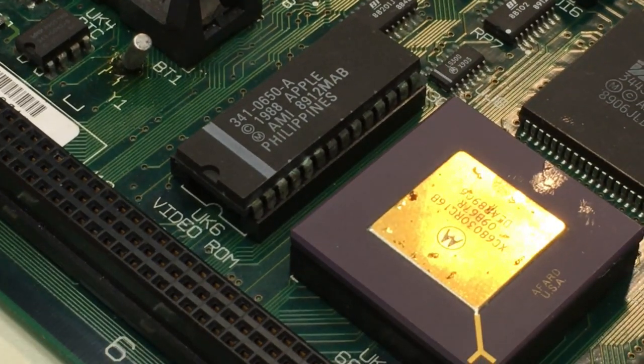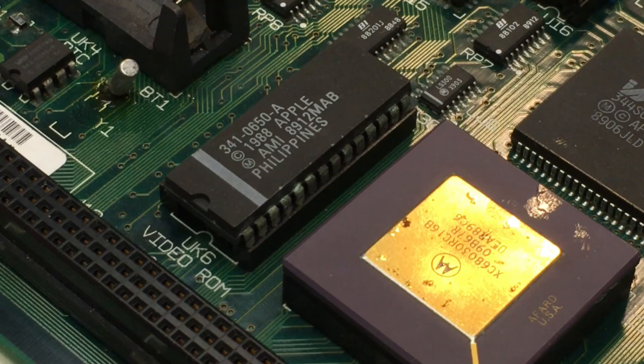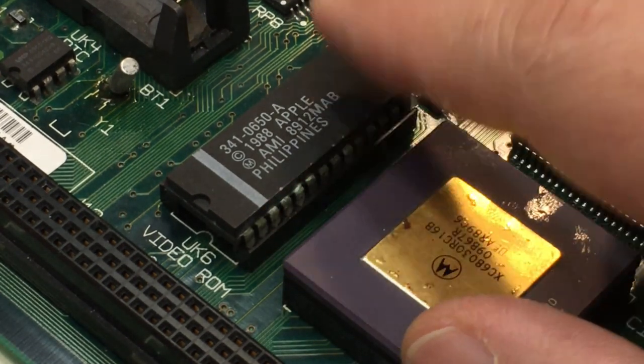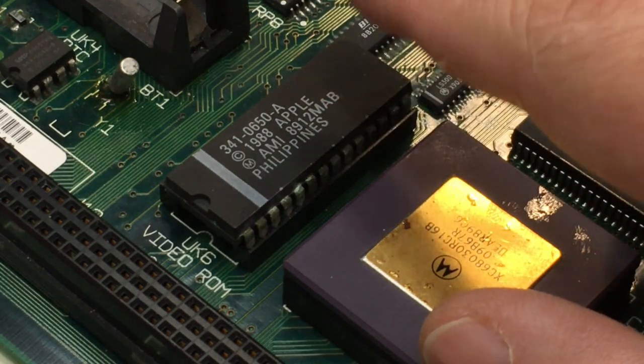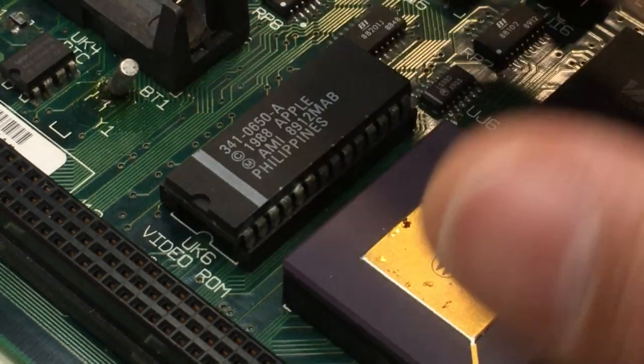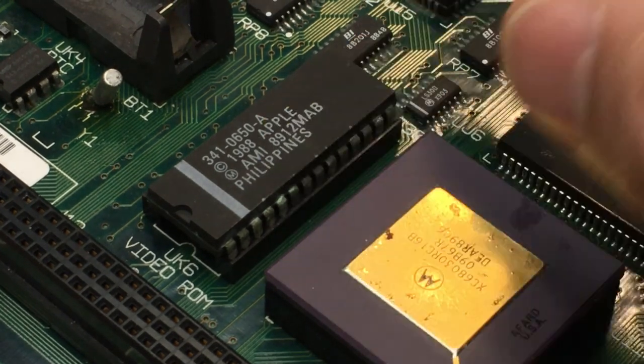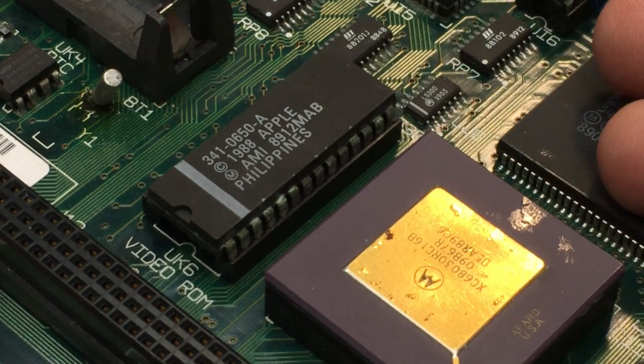The video ROM here is a corroded, absolute mess. It's just crusty and green all across there. Again, we'll have to test to see if that works. If the chip works, we can just clean up the pins in the socket and reuse it. If not, that's a pretty standard chip there. We just have to find the ROM online, burn it to a new chip, and put the chip in there,